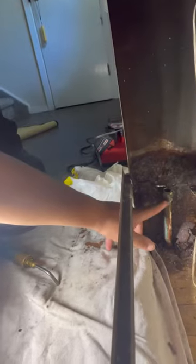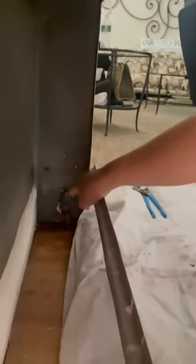We're about to start disconnecting these old fittings. This is a solid end, so we're going to unsweat this and sweat this valve over here on this side. We're doing it this way because we need meat in the bone — meaning we need pipe — because there's only so much pipe from the floor to the actual fitting. This L bracket right here is where the element sits on.